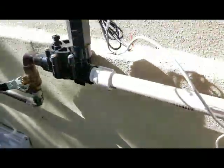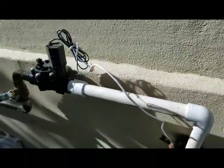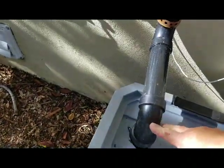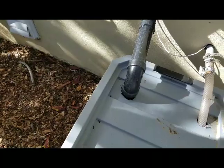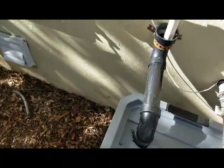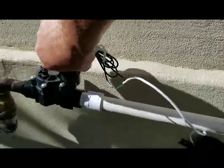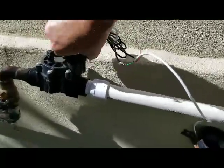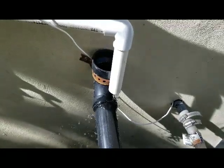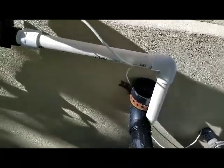It's on a timer. So when the homeowner takes off on vacation, the timer will be set to let water flow through that pipe and into the system every day for about five minutes on a gradual basis — it's not a very fast flow. It's fast enough to fill up the tank and let it flow by gravity down into the system.